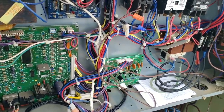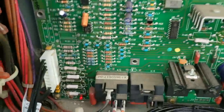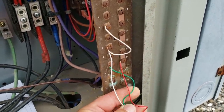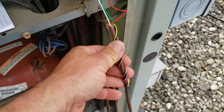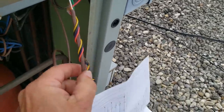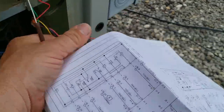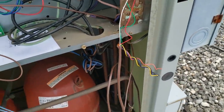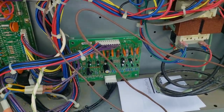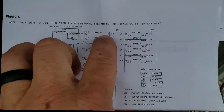Opening it up and just sniffing around, I can smell something electrical, and we've got a light down here on the bottom. I don't know Trane's number system here - these are new thermostats. Maybe they didn't hook up Y, because all I see is G, R, and W. I'll have to go back down and double-check. I'll check voltage. The one thermostat I looked at actually had the terminals hooked up. This looks fairly newer, so they've had to convert this to one of those interface boards so they can run with a regular thermostat. I'm no Trane guru.